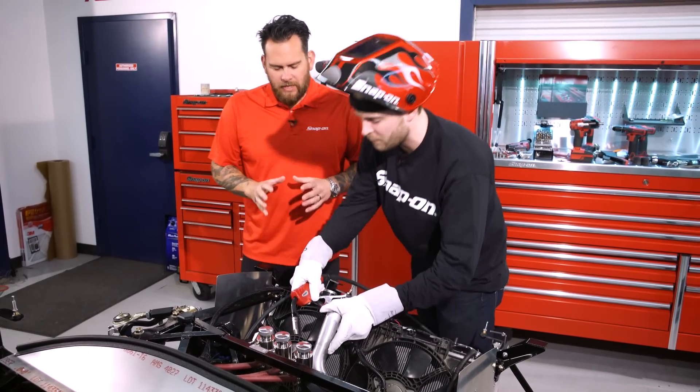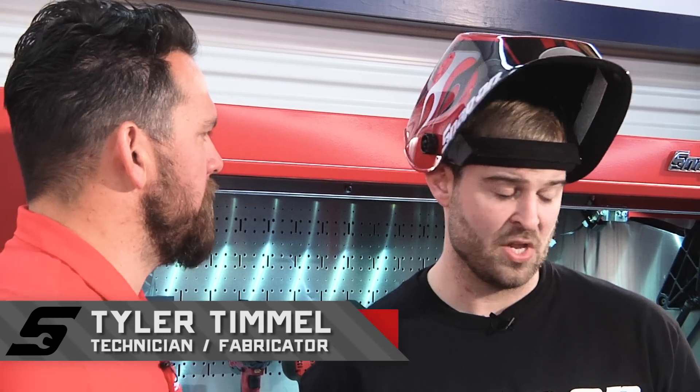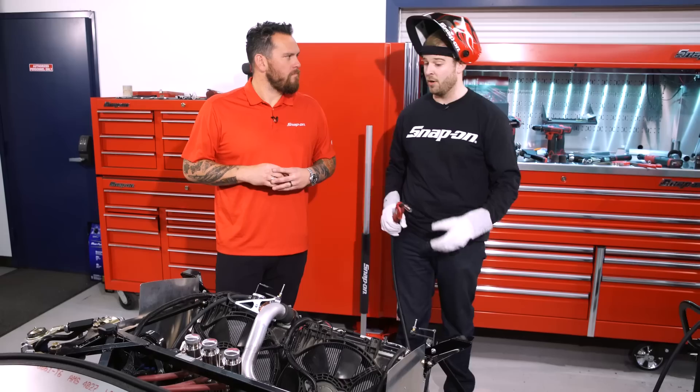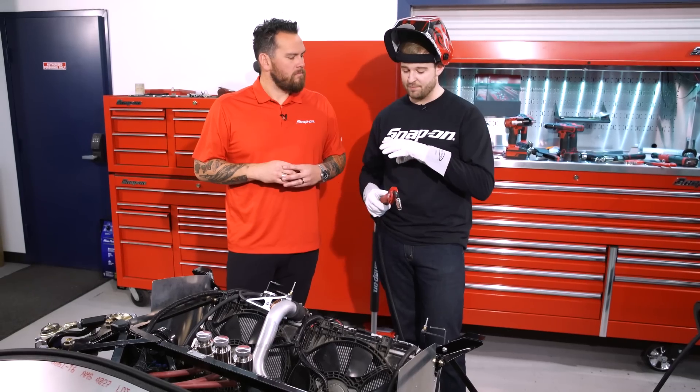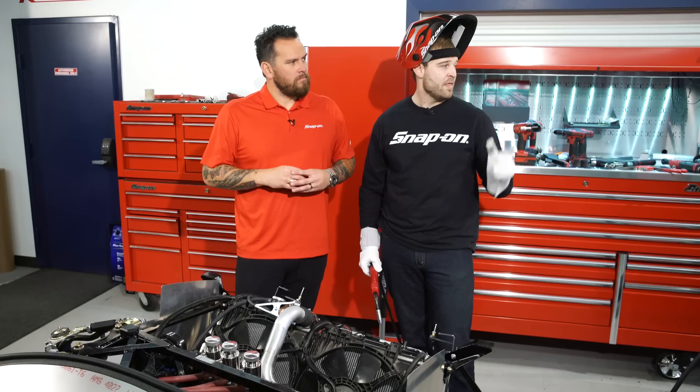While Tyler is inspecting his work, I've got to bring it up — that's aluminum and that's not a spool gun. I'm using the new 160i, which welds stainless steel and mild steel, but also welds aluminum very well. This gun is a standard style MIG gun, doesn't have the big spool on it. I'm using this to tack up the aluminum hard piping for the car, then taking it over to the bench and finishing it up with a TIG welder.